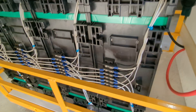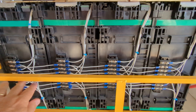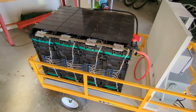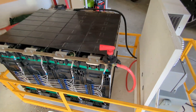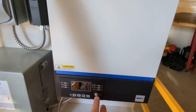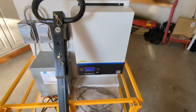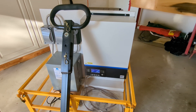What I ended up doing was wiring all the cells together in parallel, so things averaged out and the total capacity ends up being about 13 kilowatt hours. There's the on switch — simple enough — and then the inverter has its own switch. The inverter I chose was an EA Sun, which is basically an MPP clone and cheap.